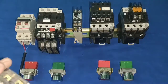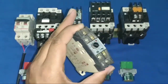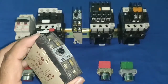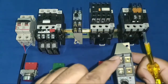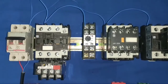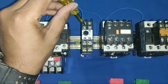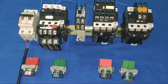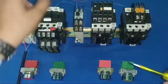For the neutral connection — our three contactors and one timer are 220V operated, so we need to connect neutral directly. We connect neutral to the contactor coil and one terminal of the timer. We connect neutral directly to all components: MCB, contactors, and timer.